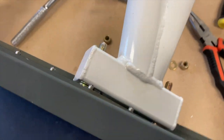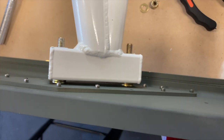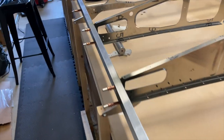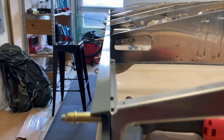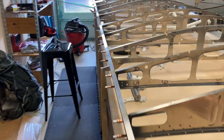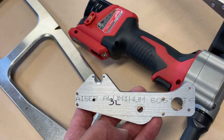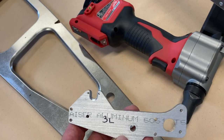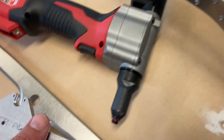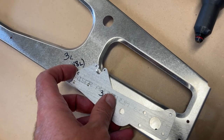Kellan's going to build that bell crank. We are using washers to space — they give you a choice of thick and thin washers. Two thicks looks pretty good for me. I put in a thin one as well, but once you sight it down it had just a hair of a bow to it, so I took a thin washer out. I've been seeing other people on YouTube use Threadlocker, like Loctite Blue. The flap teleflex and bell crank mount is quite a bit thicker than the other hinge arms, so make sure you're using the correct rivets — in this case AAPQ-45s.